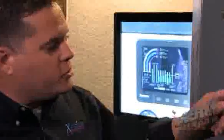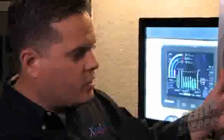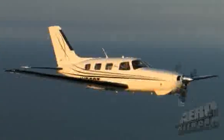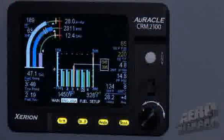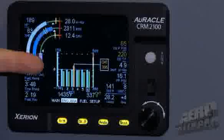If I tap that function button there, you're going to see that I've normalized the exhaust gas temperatures — brought them all down to an even playing field, about a zero point — which allows you to run some diagnostic tests. It's also very valuable during cruise: once you've set up and leaned, you can normalize those and bring them all down to a common level. You really shouldn't see any change in exhaust gas temperature as long as you maintain the original altitude and cruise power. For instance, during a mag check — which has traditionally been done at run-up — you're going to be looking for an RPM change when you switch from both to left or right. With a product like this, when you switch from both to your left mag, you're looking for each individual cylinder's exhaust gas temperature to rise, and that gives you a good look on a per-cylinder basis.